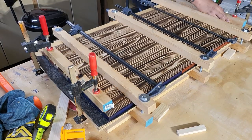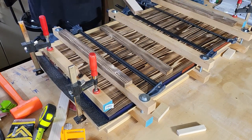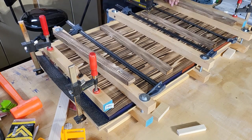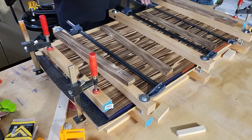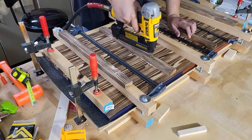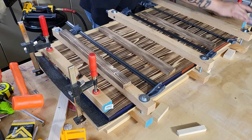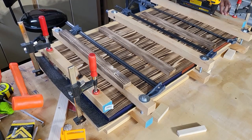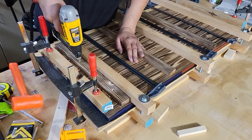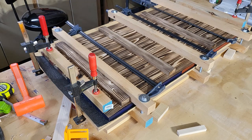This is construction grade wood, so it's going to have a bit of bend and twist to it — the jig ensures it glues up nice and flat. Next, I clean up any squeeze out with a damp rag and then install the back supports by applying glue and using one and a quarter inch 18 gauge brad nails to secure them to the back. The important thing is to install the two supports with keyholes on the outside ends with the keyhole at the top of the flag. I'll be doing a detailed video on this jig soon with plans available on my website, along with plans for other shop furniture and projects. Subscribe if you want to be notified when that comes out.